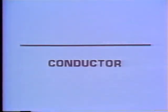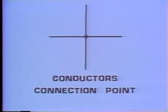A single line like this indicates a wire or conductor. This one indicates that conductors cross each other without being connected together. This one indicates a junction point where conductors are connected together. And here's one that's a little different, but it still goes with conductors. This is the symbol for a ground.